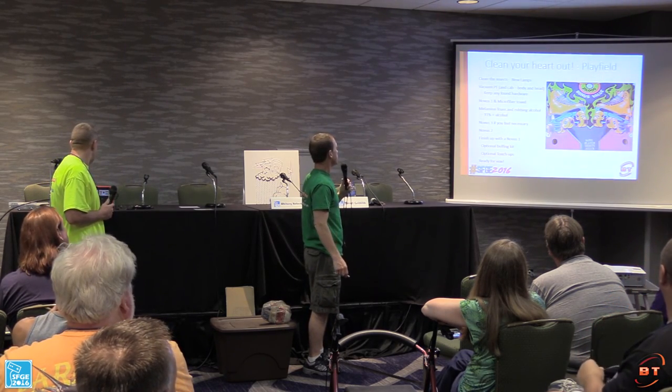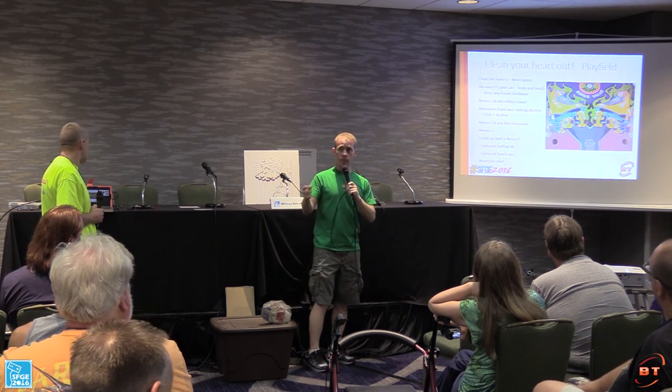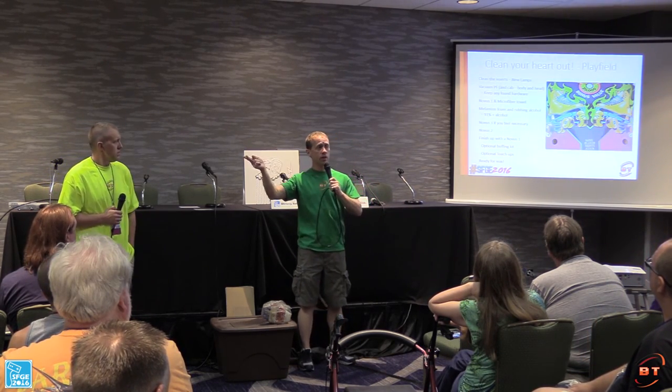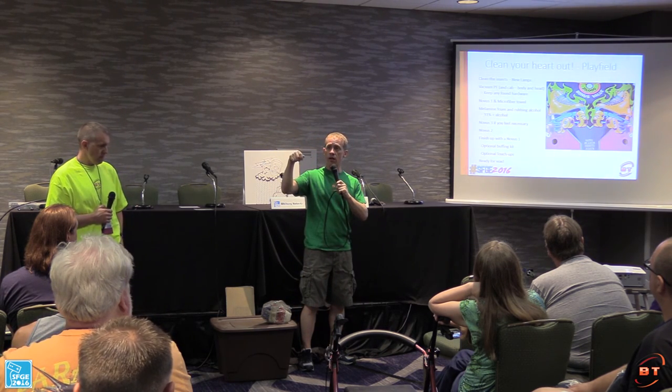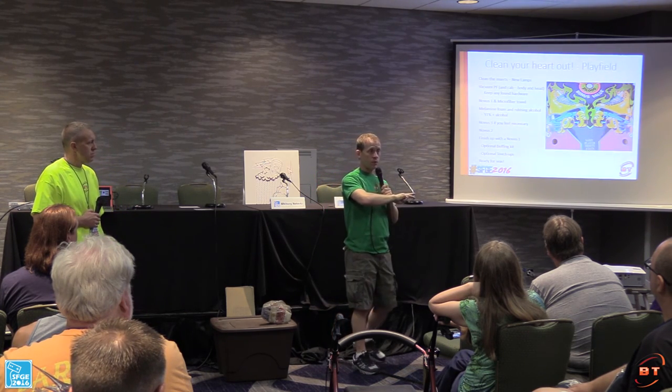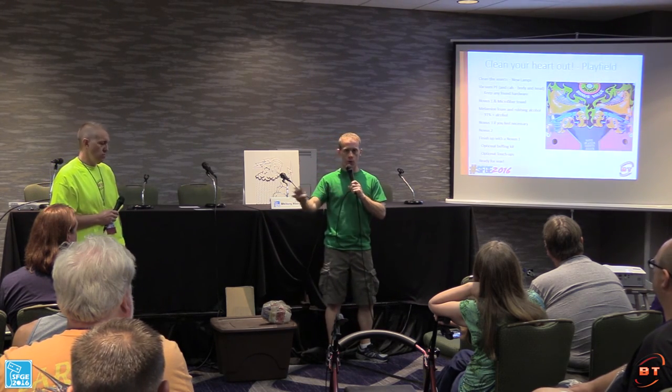And I mean that. Now the playfield's disassembled, clean the inserts. A lot of people don't think of doing this. Stand the playfield up, pull the lamps out, take a Q-tip, clean the inserts out, and then put a new lamp in it. I suggest, if you're gonna do a machine end-to-end, take every lamp out of the machine and throw it away. Working or not, throw it away.